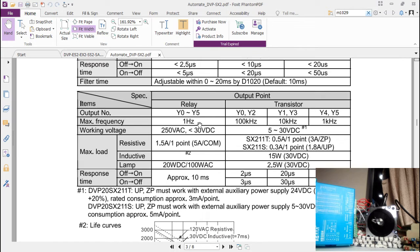If you go above 1 Hz — on, off, on, off repeatedly — you'll damage the relay very fast. Usually a relay has a lifespan of around one to two million clicks, which you can verify in the datasheets. What we are dealing with today is a transistor output.